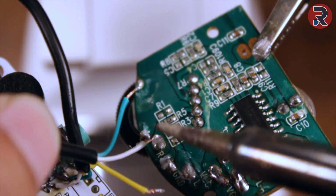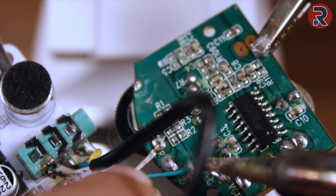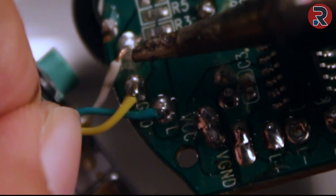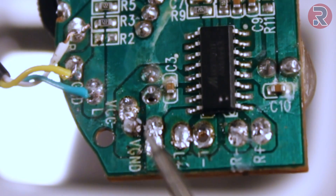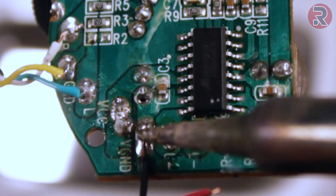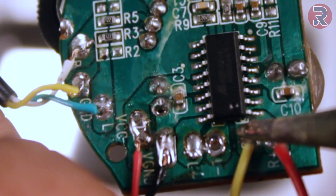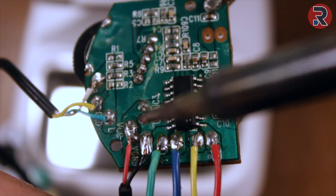Here, this white wire is right — solder here. Green is the negative and you will always see this one is ground, this one is the 5-volt positive pin, and this one is the 5-volt ground pin. Right speaker positive, right speaker ground, left speaker negative, and this is left speaker positive.